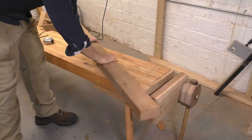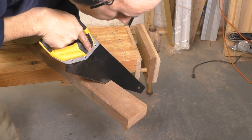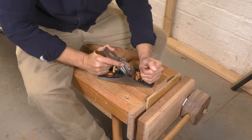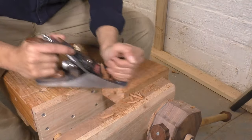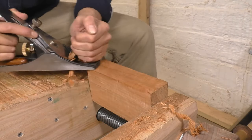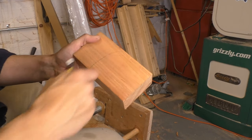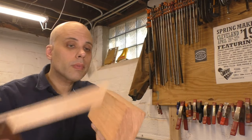Don't worry — I have come up with a foolproof method that will let even a total beginner get this mortise right on the first try, even if you've never cut one before. First, let's prep our stock. I'm using a piece of rough cherry for this build, mostly because I had it and it's big enough. This project requires a lot of layout and you need a straight and square block to begin with. This piece was really uneven and I probably spent at least a half hour planing, checking, and marking clean faces and true 90 degree edges.